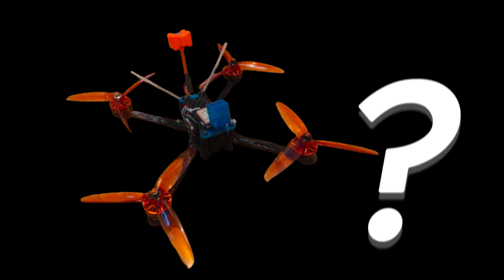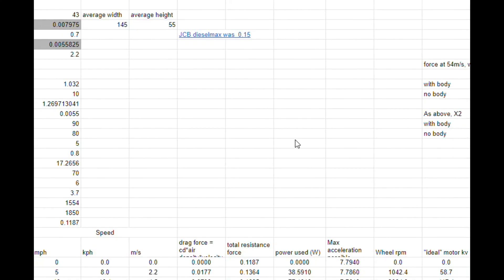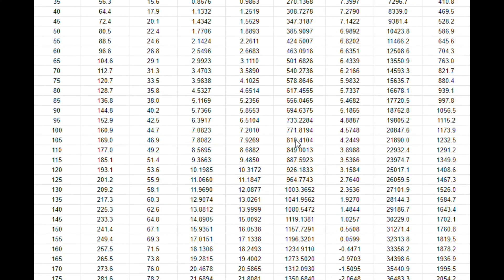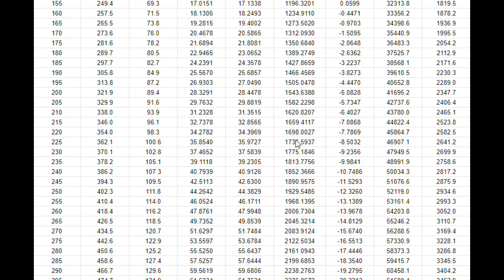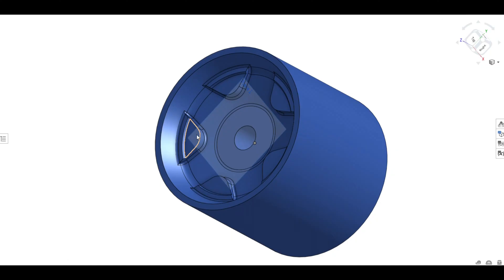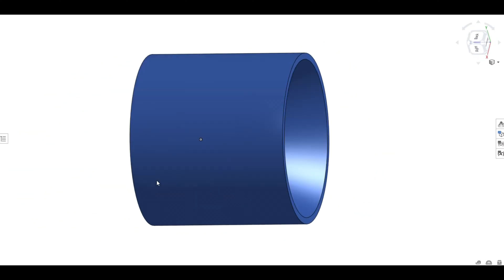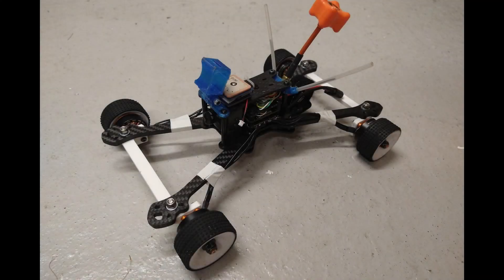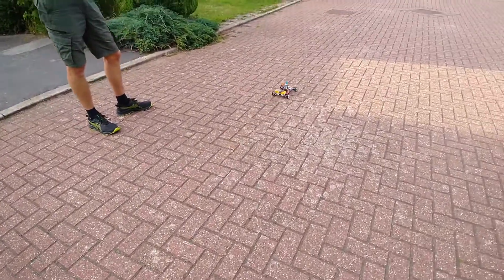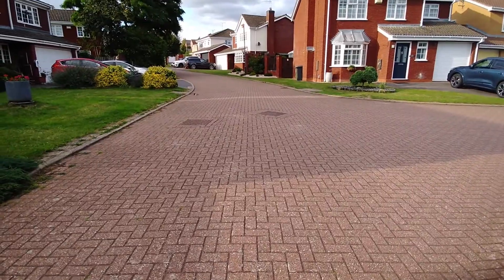I still don't really know whether it would work with a standard flight controller. At the same time I did some calculations based on the motor KV and what voltage I was putting into it and tried to work out what speed it would do. It looked like I could use the wheels from my mini RC project, which are about 43mm diameter. So the next stage was: I took my drone, made some brackets to mount the wheels on the side of it, put my little mini RC wheels on, gave it a try — and it seemed to work. The rest is history — I developed it from there.